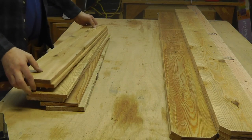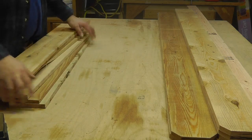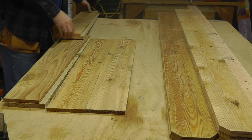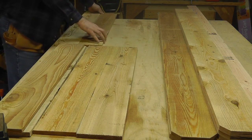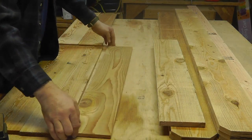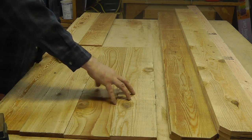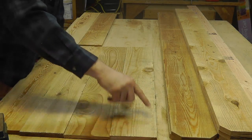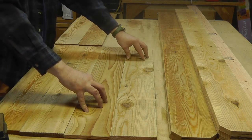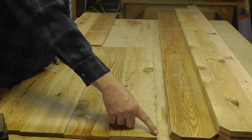Here are the six pieces cut at 35 inches each. I'm going to take two of them and lay them together — that's one side — and another two for the other side. For the tops of the sides, I'm going to clamp two boards together, take a straight edge from corner to corner and draw a line, then cut diagonally across. That gives me two matching pieces — one stays on that side panel and one flips over to the other. Rather than measuring the exact angle, this method keeps it simple.